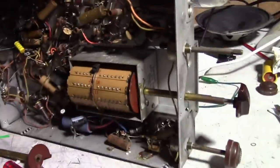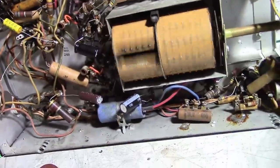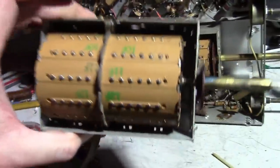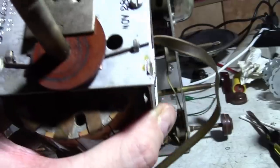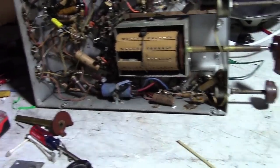But, okay, that tuner transplant seems to be a success. So this is the drum that came from that Canadian set, so it is missing that channel 6 segment. I can try taking one out of, say, this. I wonder, though, I just realized these all have F on them. That could very well have a significance. This is a different model tuner. Well, maybe I best start with popping the channel 6 slugs out of the drum that came with this set.